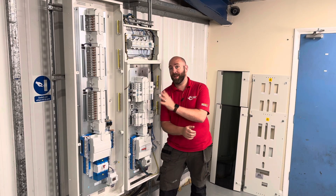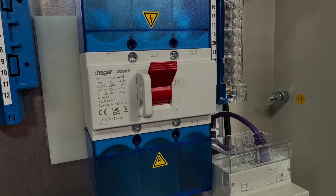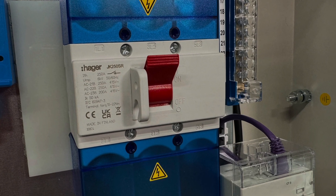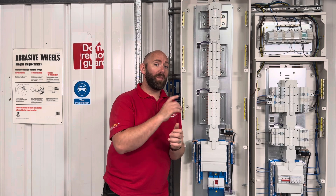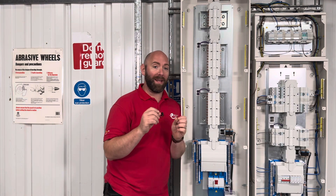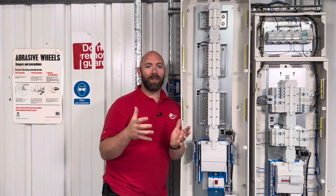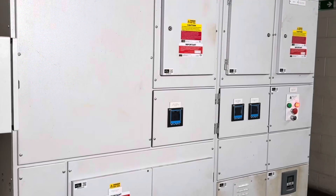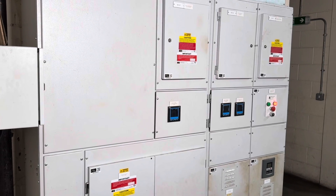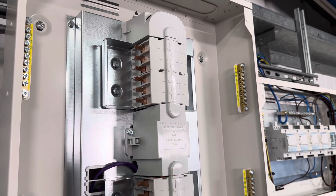You can see I have some wiring in this 125 amp one, which is going up to this contactor bank at the top — I'll come back to that one a little bit later. The electricians haven't put the supply in yet for the 200 amp one, which is a great opportunity to look at the construction of the board. So the obvious thing with this board is it has three sections, or what we call pans — a lower pan, a middle pan, and an upper pan. This means we can separate out power, lighting, and mechanical services over the three pans. Hager have essentially taken what would normally be a plant room and engineered it into this magnificent unit.